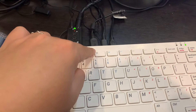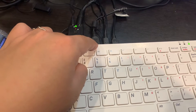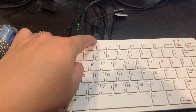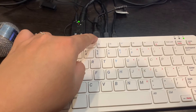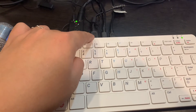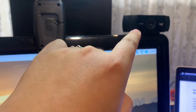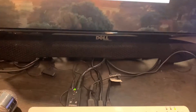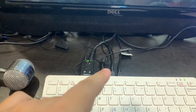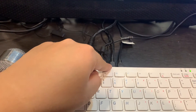The second component is a USB webcam connected via USB. This is because the Raspberry Pi's own camera processes raw footage and uses a lot of processing power. It's best to use a USB webcam because it compresses the video and then sends only the required video to the Raspberry Pi, so the Raspberry Pi doesn't need to compute so much processing power.